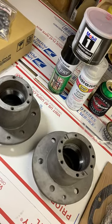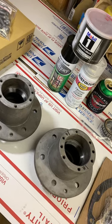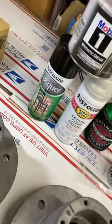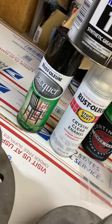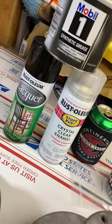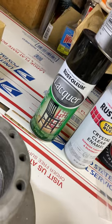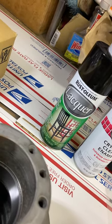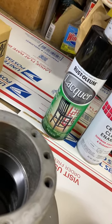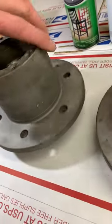I've seen these things in silver, pewter, and black in pictures — I'm just going with black. I'm a fan of lacquer. I don't like Rust-Oleum enamel. Crystal clear enamel is actually a lacquer. I'll do three mist coats of regular lacquer because it's DTM — direct to metal. No primer, no industrial enamel garbage, because you can't re-coat over that. It turns orange peel and flashes.